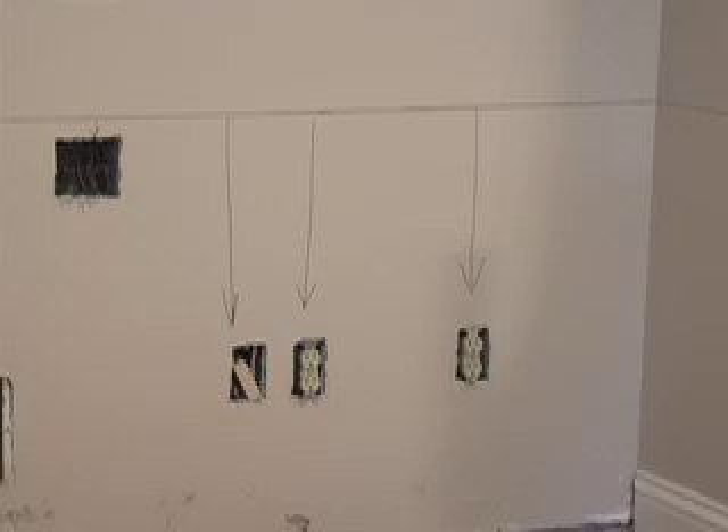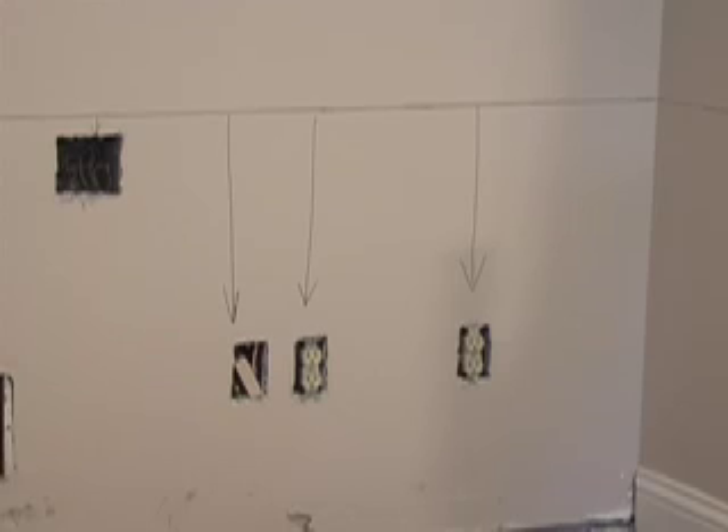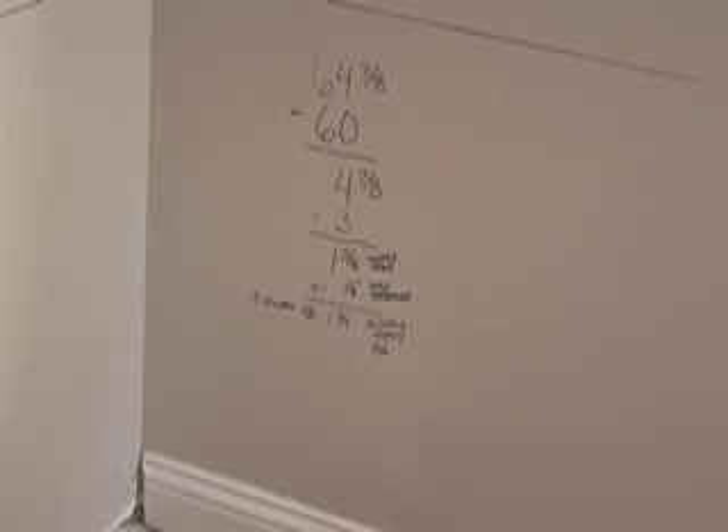This level line is also where all my down measurements will come from — the measurements I'll cut for the boxes into the back of my cabinets. You don't want to measure up off the floor, because with the cabinets shimmed off the floor you'll miss your boxes.